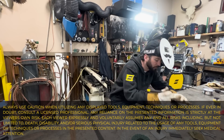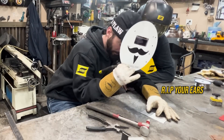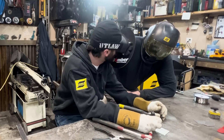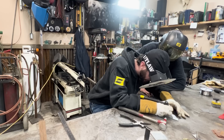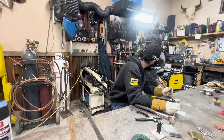The first one you're probably pretty familiar with - we're just going to do some simple stainless steel to carbon steel, a butt weld. I'm just going to pinch everything together, make sure it's touching, barely tap my foot pedal and get something to fuse and back out. We're at 75 amps - we could probably go a little thinner. You see how it wants to run away from us? That's where we want to even consider going down in the amperage.